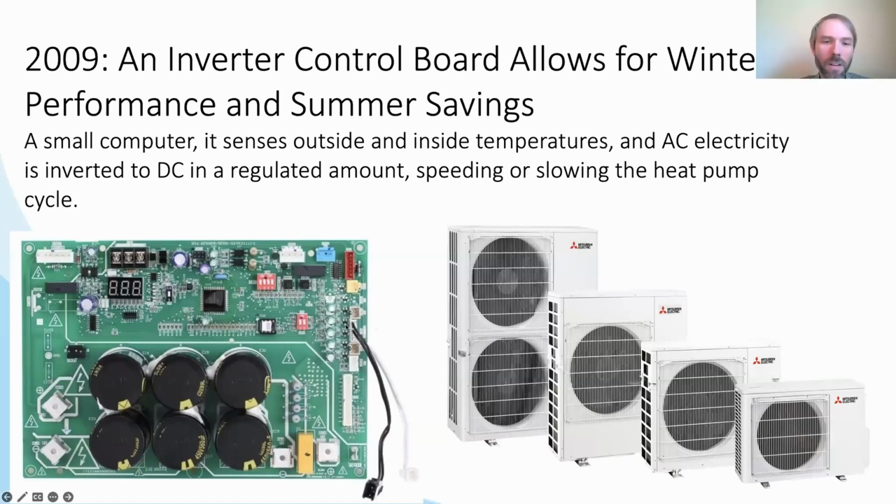But ground source heat pumps are really important in the central part of Canada and northern Alaska. Air source heat pumps, these big old fans, that's all you need up until central Canada, like a computer with a big old fan. And of course the right refrigerant and such. But yeah, like the Mitsubishi Hyper-Heats, the Carriers, you're not going to get the lower startup with a ground source heat pump. Like it just seems like, and maybe I missed part of it, it's that startup is just the worst. Well, Tom, why don't you speak to the kick-in startup voltage surge that I think Brett's speaking to? You're the mechanical engineer.